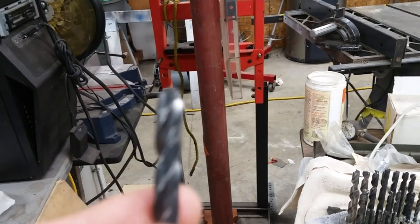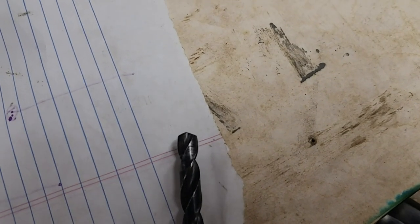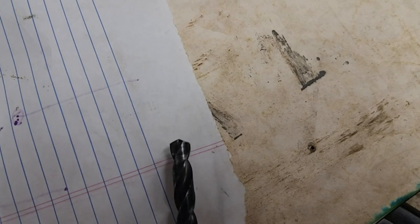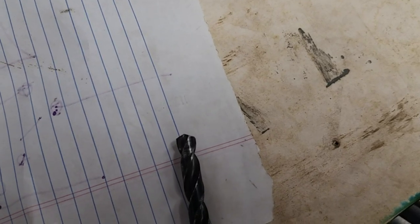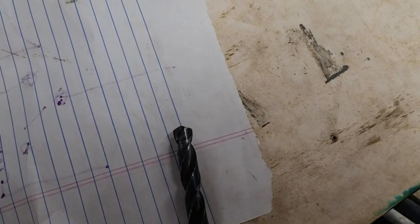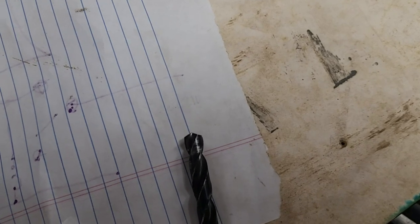The angle is about 132 degrees, so it's not too far off 135. But the two cutting edges - the tip's not in the center and one corner is chewed off. There's about ten thousandths difference between the two cutting edges. One was at 45 degrees and the other was at thirty-something. So I'm going to put this in and show you up close what it starts doing to the tip.